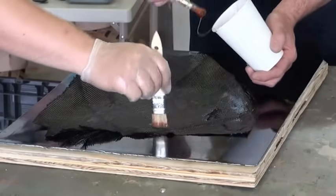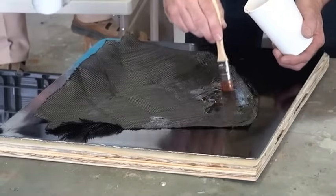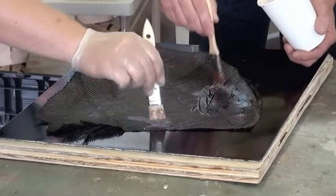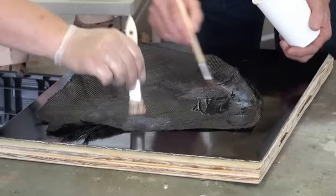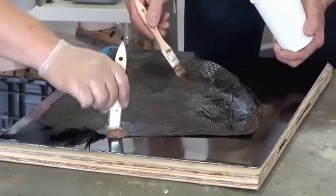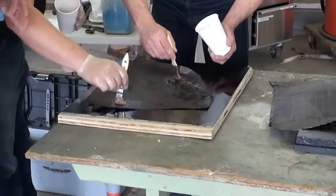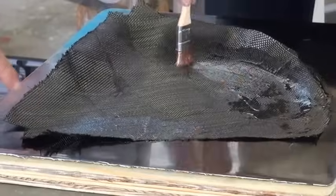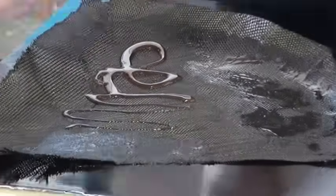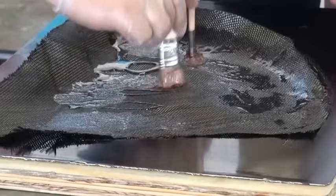This is a really flat part. I've got a big advantage in the fact that it's a really flat part compared to where you've got a lot of really weirdo curves and stuff going on like that. A lot of times you're going to have to lay out very specifically with, like this first piece that I put on here, you see that I've got to cut on a bias for this, my hardest angle that I have to make going up like that, and then come back over and cut that on a bias so that that first piece lays over as cleanly as possible on that one little edge that's on there.